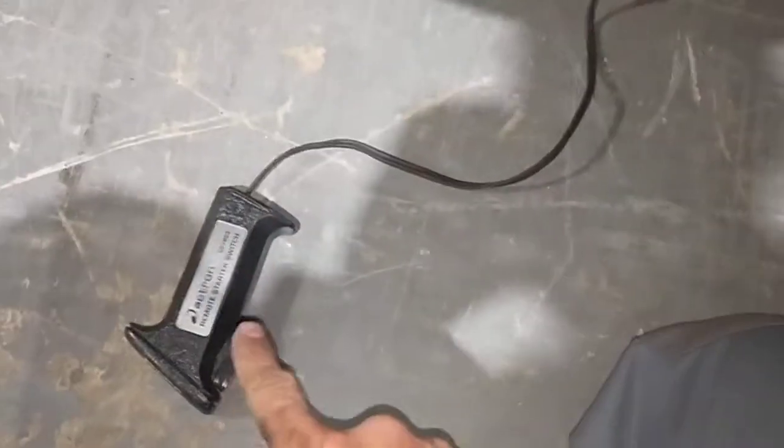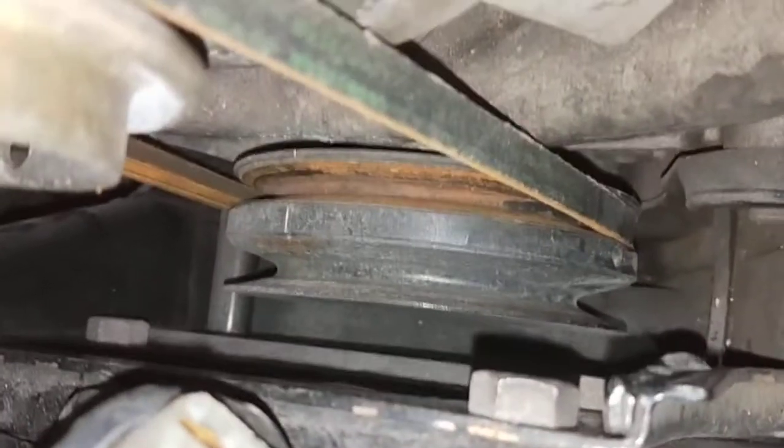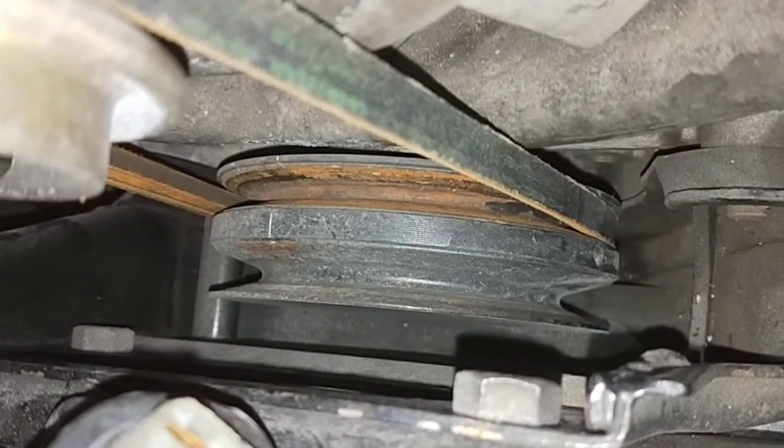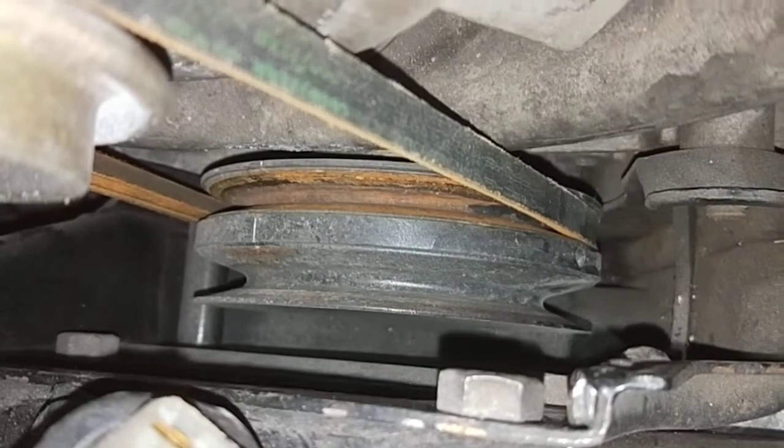Alright. I had to bypass the starter motor myself. I had to bypass it, so I'll show you what's happening. Alright, I'll show you. That's been run. I've run that wire straight to the starter motor to turn it over and see if the engine turns. I've got a switch here to turn it over and see if the pulley, if the crankshaft is moving. See how the starter motor is working? I'm pushing that.